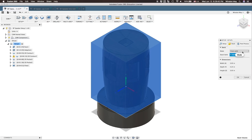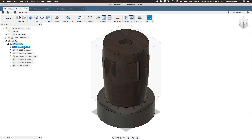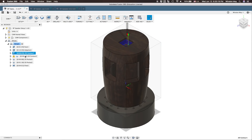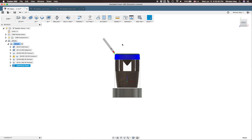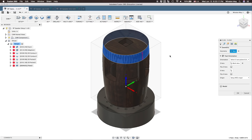First step in the CAM process is the setup. I assumed I was starting with a 3x3 inch bar of stock surrounding my enclosure. The origin needs to be set at the center of rotation of the B-table model. Toolpath 1 is a facing operation on the positive Y-face. My speaker is 4.125 inches tall, but my stock might be between 4.15 and 4.2 inches tall, and this model is upside down for a reason you'll see later. Toolpath 2 is an adaptive clear to rough out the top inch — the bottom of the enclosure. Then I'll contour out a square pocket for workholding purposes on the flip side, and add a hole to accept a quarter inch screw. Next is an eighth inch square end mill to clean up the bottom face using a low step-over pocketing toolpath. Finally, I applied a flow toolpath to the bottom five-eighths of an inch of the enclosure, using a patch that's a subset of the outer surface as a containment boundary.